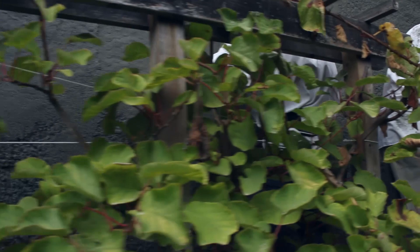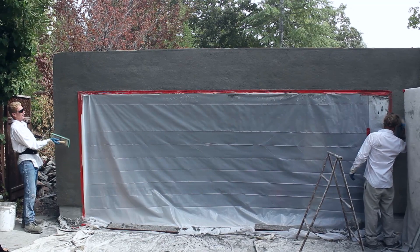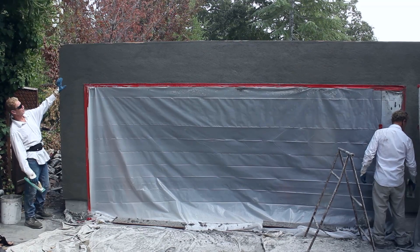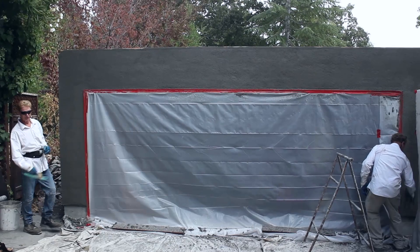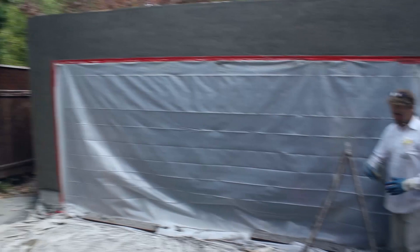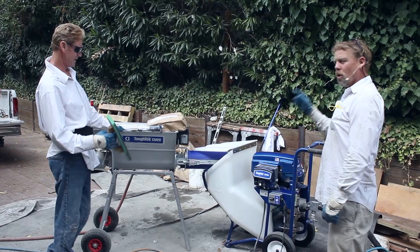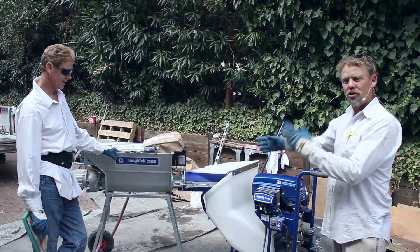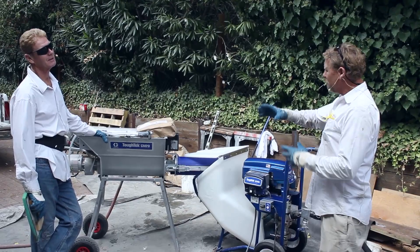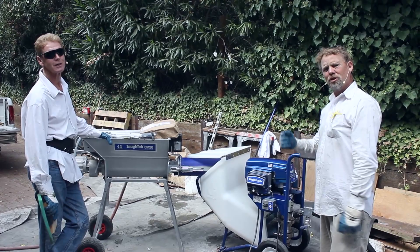Nothing we can't handle. After you shoot your base coat on, what I do to match the finish of the house — which is a light knockdown dash — I bring some of the aggregate out. I can see the polystyrene coming out — that's great, that's perfect, that's just what we want. So we've got a very light dash already. We're going to use the machine to dash. I personally think the machine setup is well organized — the harmony of it. Andy, what do you think? The mixer lets you set the water volume to get your consistency just perfect. You don't have to adjust each mix — it does it all by itself after you get it set up. So every mix is consistent, and when you're spraying it's just perfect.